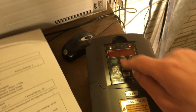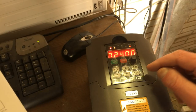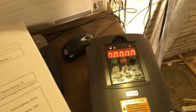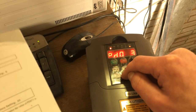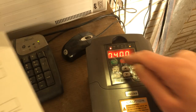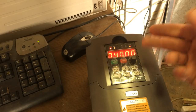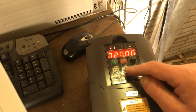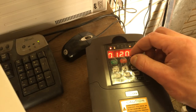If I run it, that's 2400 RPM — still higher than if I use 20 Hertz. There's something else going on: PD11, if I remember correctly, is set to 40 as minimum, which is 2400. It's some sort of safety so you don't screw up your spindle. I'll change that so I should now be able to run it at 1200 RPM.